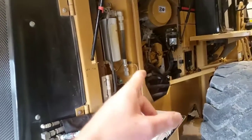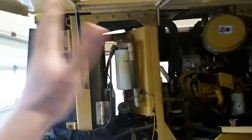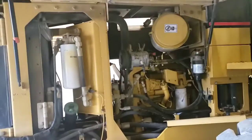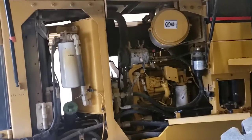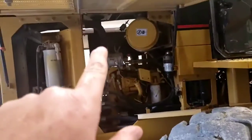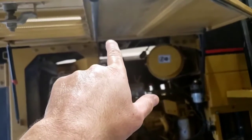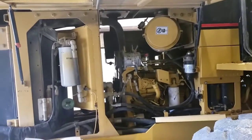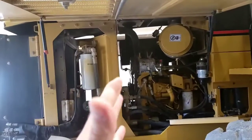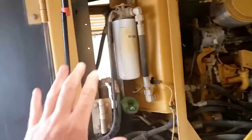This is basically just a hydraulic fan belt - as you rev the engine up, the fan pump turns faster, therefore the fan motor turns faster, therefore the fan turns faster. The reason for not just having a fan belt comes down to emissions. On a modern machine like this, the engine is basically sealed in one compartment - we don't have ambient air traveling across the engine block, so they can regulate engine block and cylinder head temperature better for emissions. A loader also uses a big exhaust pipe to create a venturi effect, drawing a specified amount of air over the engine based on exhaust flow rather than a fan.